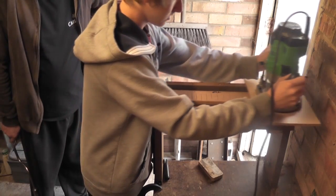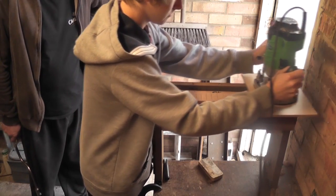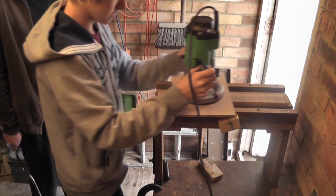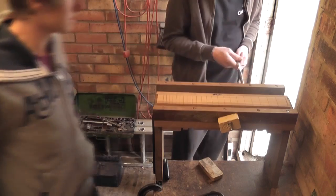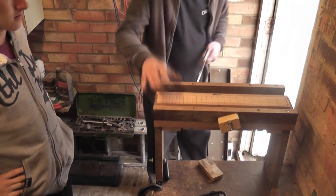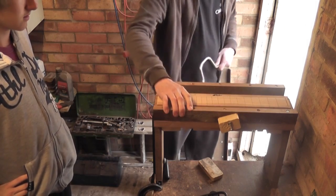To start, my bolts are set in the middle position so the top table should be flat. I then plunge my router bit so it just scratches the fretboard and route over the top of it. You could say that this zeroes the fretboard and makes it reliable with the rest of the fixture. So now I can undo the bolts to the 0 position so that the table is all the way to one side and route off the first edge.